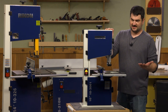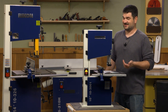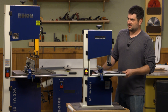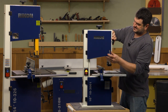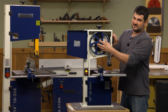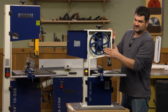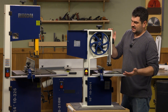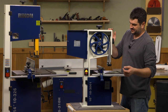As you look at it, I don't think we need to take a DNA test to see who the daddy is here — it's definitely a scaled down version of our 14 inch here that we have in the shop. Some of the features I like about this one: it does have a cast iron flywheel. A lot of the cheaper models are going to have aluminum flywheels. It's just going to be a little bit heavier duty, give you a little bit more momentum and maybe less vibration, so you're going to get a little bit smoother of a cut.